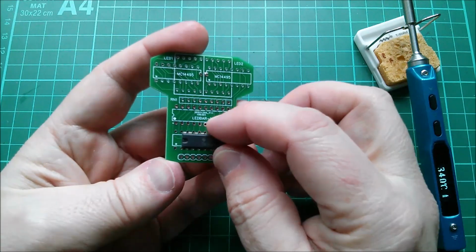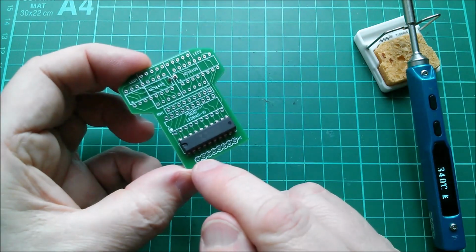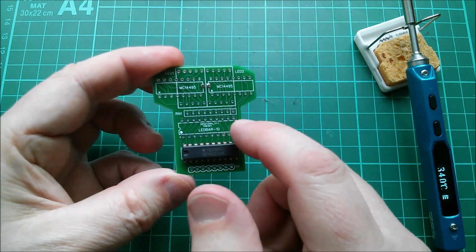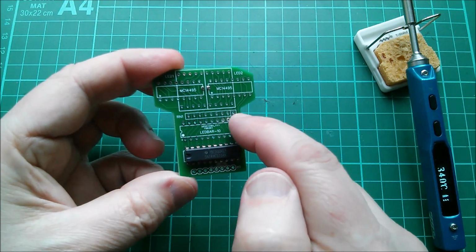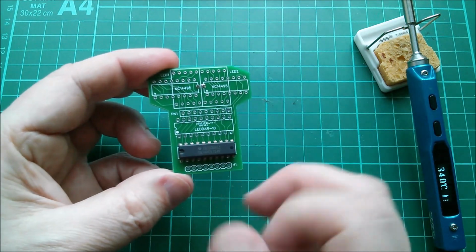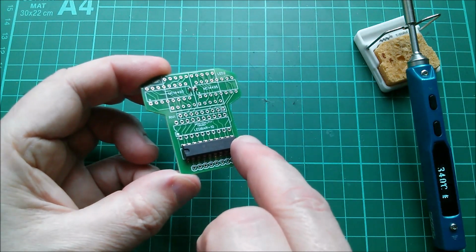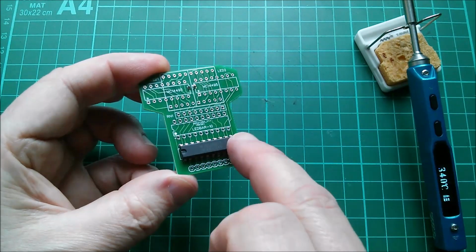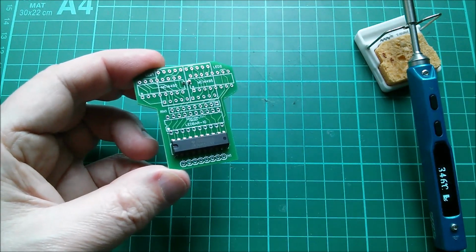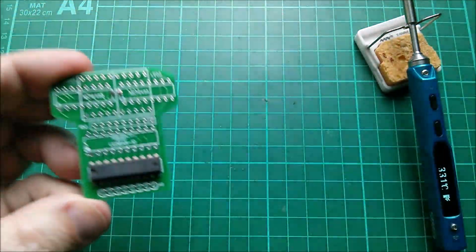Okay, so the first chip goes into the board. That sits there. I'll probably put some right angle DuPonts in there. Then this should drive the LED bar. And if I put the single inline resistor pack in there, then this should work as a binary display with a one CMOS load. This is why this buffer's in here, because I didn't want to load my breadboard computer. I wanted it to present just one CMOS load.